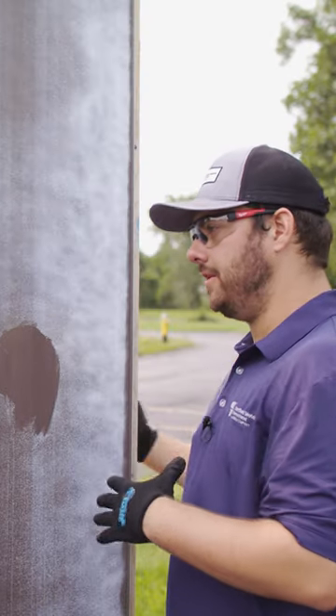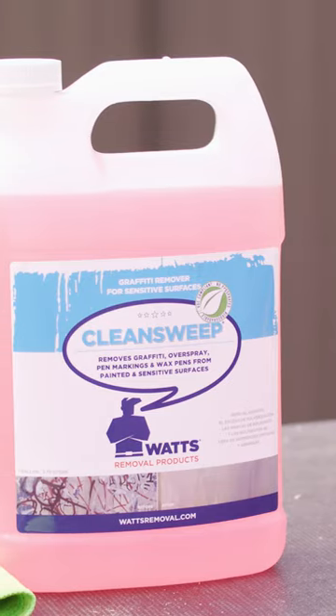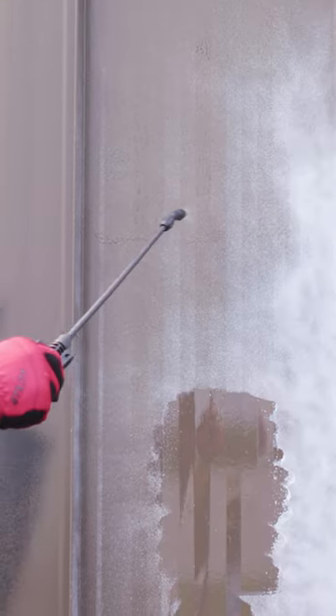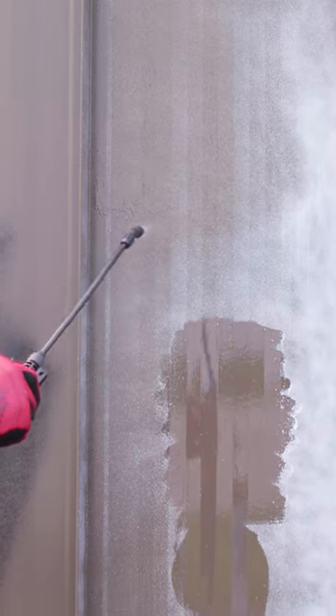So if you have a big area and you need to fix a large area, what do you do in that situation? In that situation, take a gallon of Clean Sweep, put it into a small pump sprayer, and then apply it. Apply it like a waterfall effect — don't just mist it. Put it on there, put a good coat of the Clean Sweep on there.